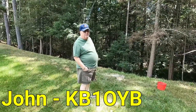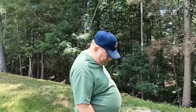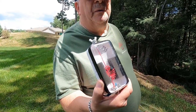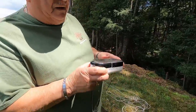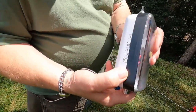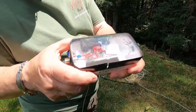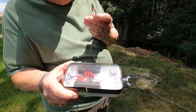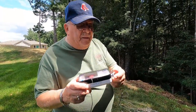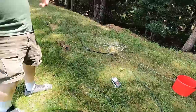So what are we trying to do? We're putting up a 64-foot wire and trying to get that wire up in a tree. At the bottom of that wire is a 49-to-1 balun — shame on me, I said 29-to-1 at first. It's housed in an old iPhone case sealed with some tape; not totally weatherproof, but good enough. Coax goes in one end, a ground counterpoise if you have one on that end, and the wire coming down from the tree connects there. It's that simple — lay it on the ground, and when you're done, pack it all up and head home.